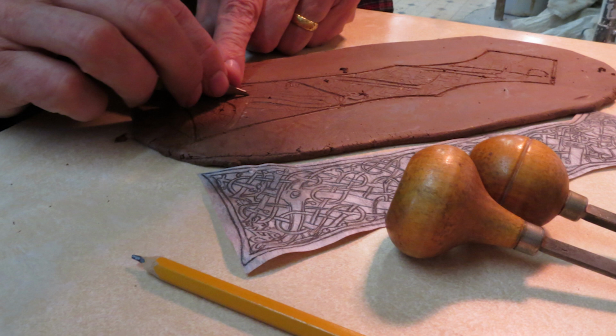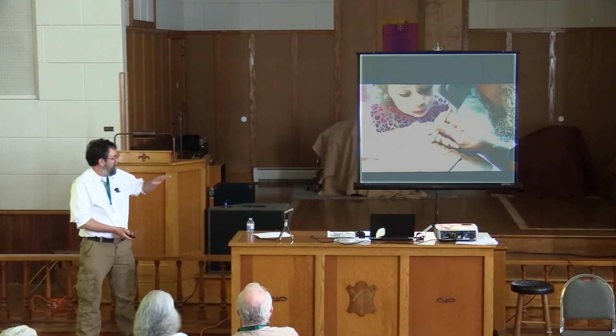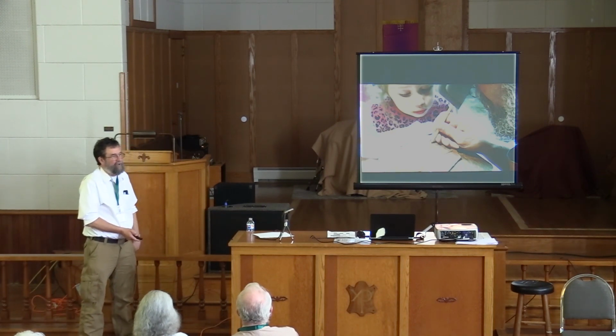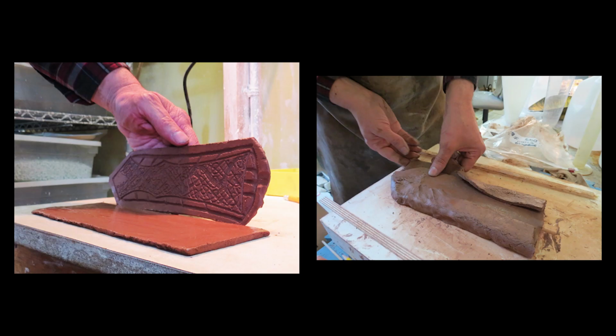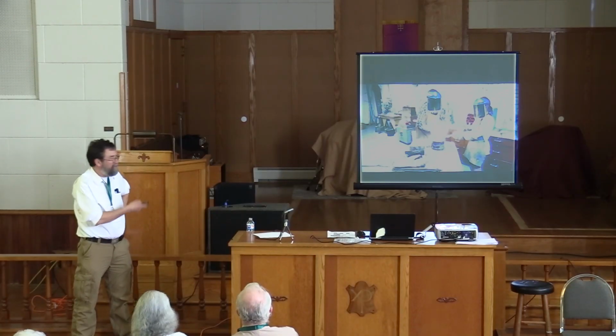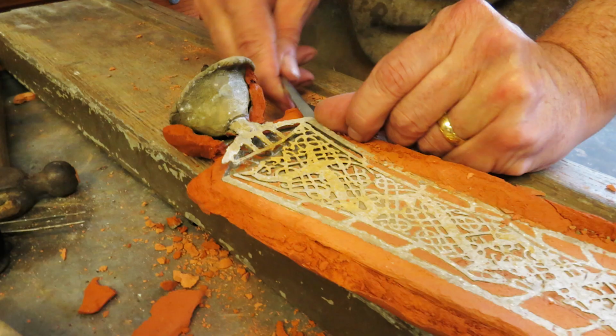Griffin sent me a scale drawing, and Betty, who was here earlier, liked to watch me work at it. And I carved the design out, leaving the original surface on the plane between them. This was carved in a leather-hard kind of state. It was not totally dry, but it was nearly dry. And then I re-wet it in order to seal it up on a flat piece for the back, and created a funnel, and we poured it. This is Lindsay, my jeweler that works with me. She did an apprenticeship with me, and still works there. She's working today, actually. And here it is cast.